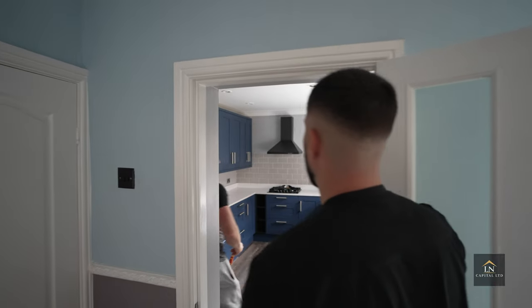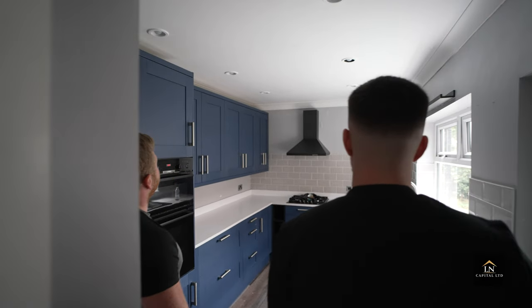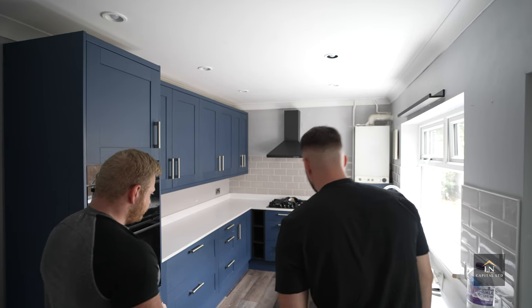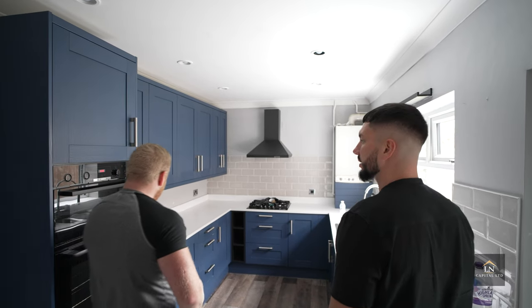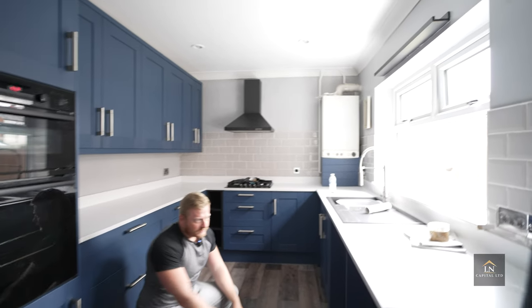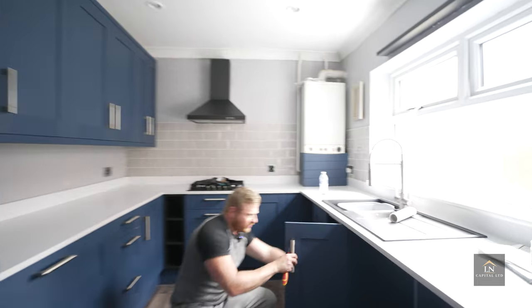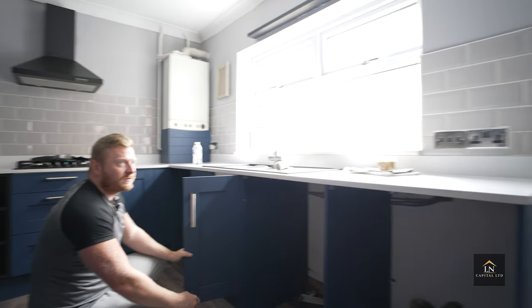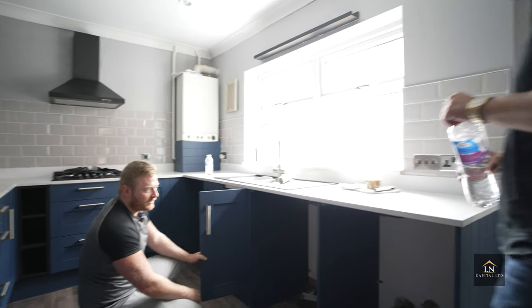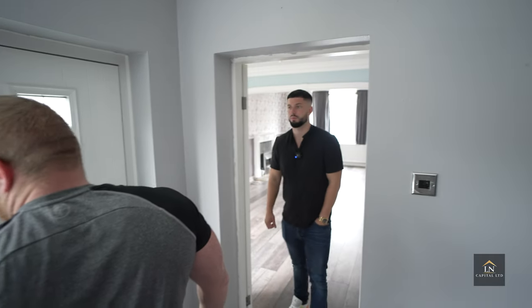We're replacing the spotlights in the kitchen. The electrician recommends LED integrated ones — heat resistant and the correct IP rating. In terms of appliances, PAT testing isn't needed for the hard-wired cooker. The sockets are already there for appliances, and the only things that might need PAT testing are a washer and dryer, but they're in isolation so we're fine.